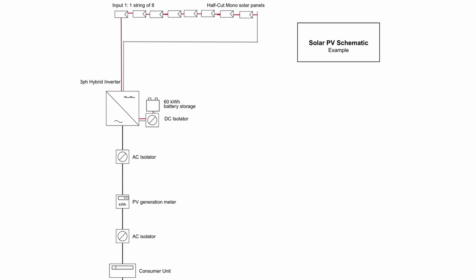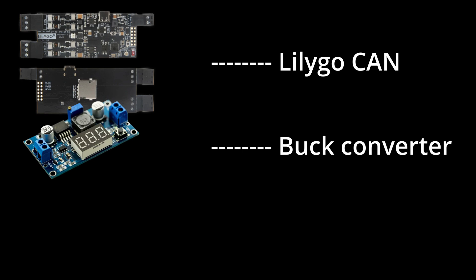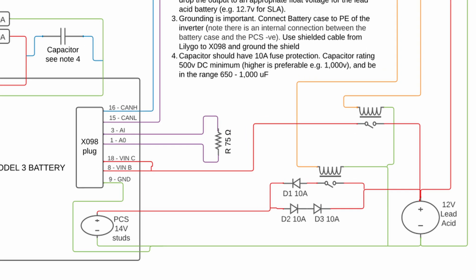Getting back to the parts list, I've got quite a list of products that I need. Some of these are standard solar inverter set-up parts that you would need for any install, such as isolators, circuit breakers and cabling. But there are a few extra things more specific to the inverter that I'm looking at. I need two of these ESP-based CAN bus translation boards — they need their own five-volt power supply. In addition to the communication, I'm going to need some solid-state relays to turn on and off the contactors within the battery pack — two or three should do me. You also need to provide the high-voltage battery pack with 12 volts to get it to activate and close the contactors. Once it's activated, that will then output 14 volts to charge the battery. So I need a 12-volt lead-acid battery, only a little one, and a buck converter to slightly reduce the charge voltage suitable for lead-acid.